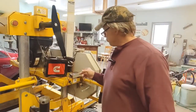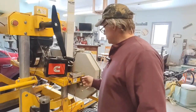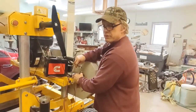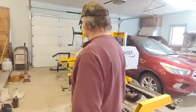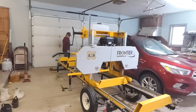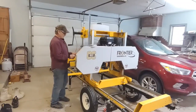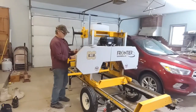I've got the pulse width modulator control unit hooked up to the battery and to the motor. We're ready to try it. First I need to see if we got power - here's the LED, the switch is off. All right, we have power. My wife just came out to witness the very first test run. Let me make sure there's nothing in the way - I don't have limit switches or overload relays on it yet. I'm a little nervous, not going to lie. I'm going to start at really low speed.